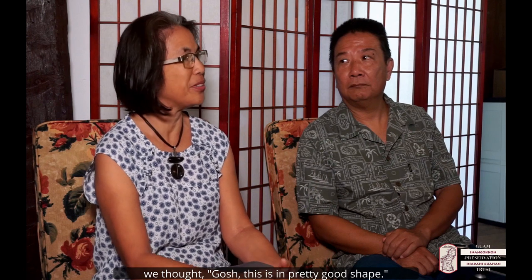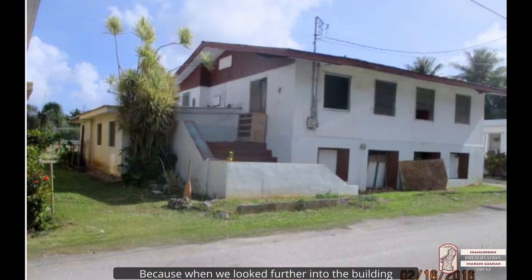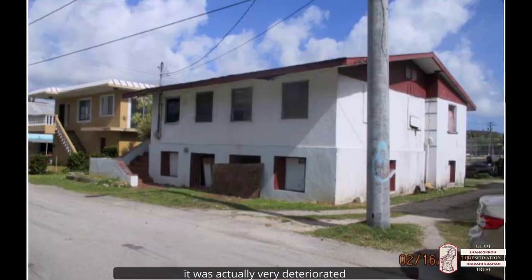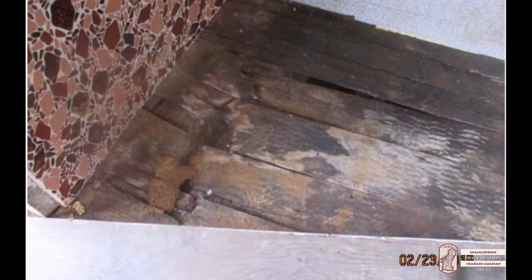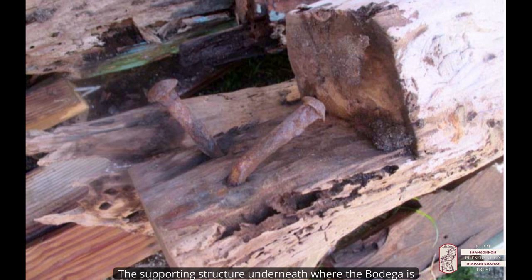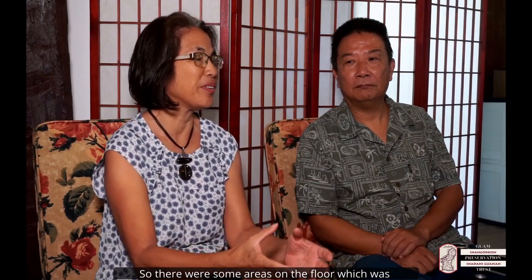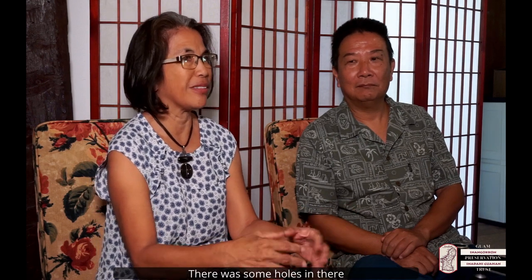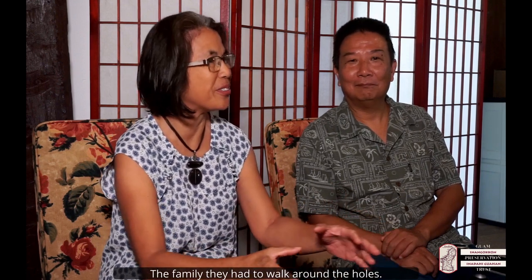The underlying conditions were challenging. When you see the Flores house initially, we thought it was in pretty good shape — looks like we could just do a little bit of restoration and rehabilitation and be done. But that actually wasn't the case. When we looked further into the building, it was actually very deteriorated. It was termite infested. The floors were in pretty bad shape and the supporting structure underneath, where the bodega is, the timbers were already failing. There were some holes in the floor, and the Flores family had to kind of walk around them.